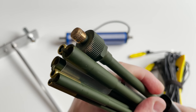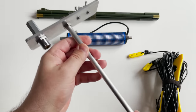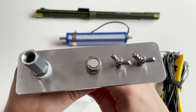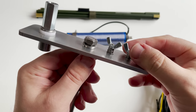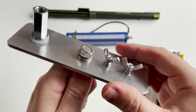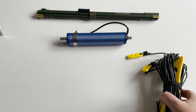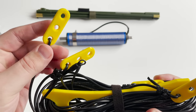The ground spike kit came with the complete kit. The spike pushes into the ground and can fully support the coil and antenna without any guy ropes attached. It has an SO239 underneath to connect your coax and a 3/8 thread on top to connect the coil. Two wing nuts attach the supplied ground radials — four in total, each 4.5 metres in length. Each radial has a 3D printed insulator at the end to help keep it straight when using tent pegs.